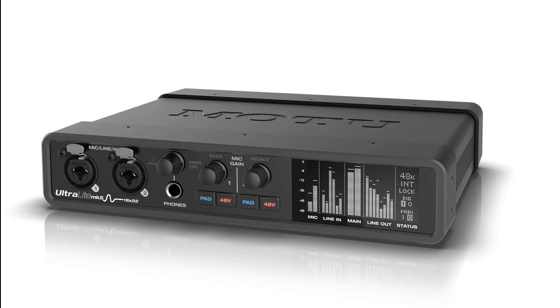Connectivity includes two front-panel XLR-TRS combo-style mic/line/hi-Z guitar inputs with preamps, plus 74 dB of gain, 6x10 balanced quarter-inch analog I/O, 8-channel ADAT optical switchable to stereo Toslink, stereo RCA S/PDIF I/O and MIDI in/out jacks, all housed in a fully redesigned steel enclosure with molded aluminum alloy end caps.